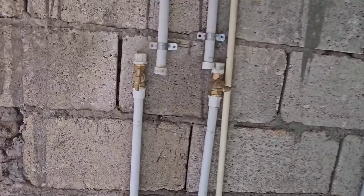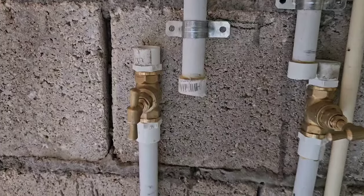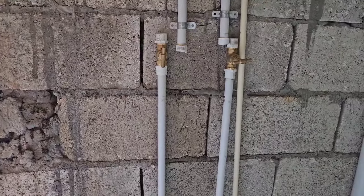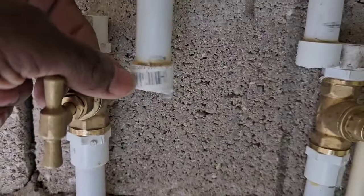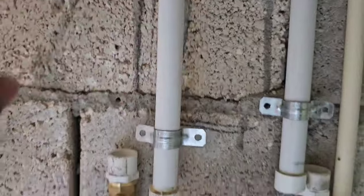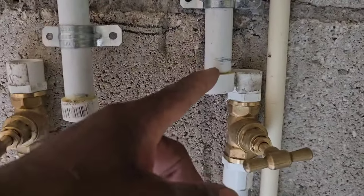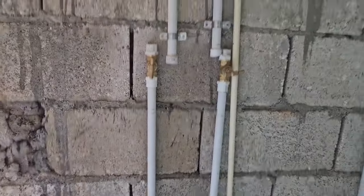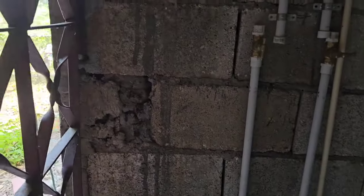Right now I'm doing the pressure test on this. The last time I connected it and pressure tested it, water was dripping. So I pulled it off. I'm going to use the technique to take these off without adding a coupling — I hate seeing couplings. I'll just slit them and drop them back inside the male adapter. That's why I'm pressure testing, and I'm going to fix it while leaving the pressure on.